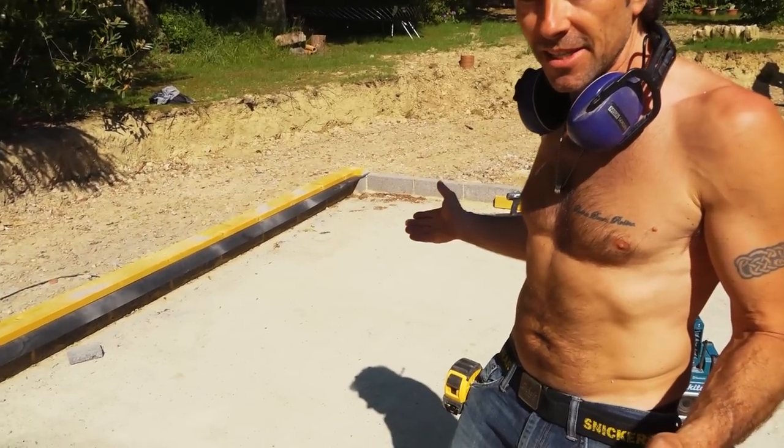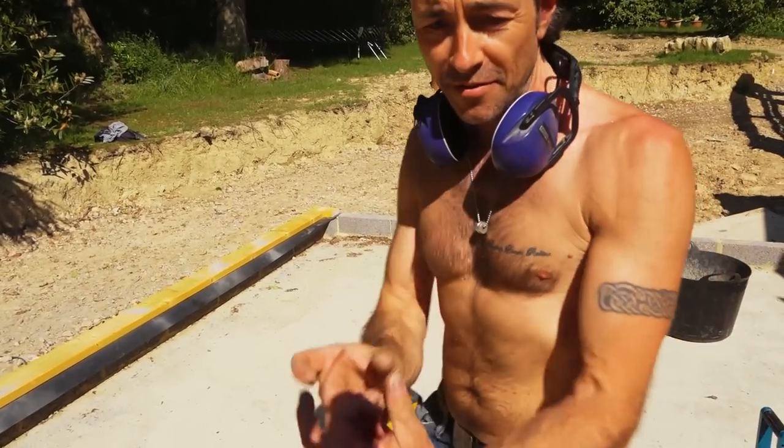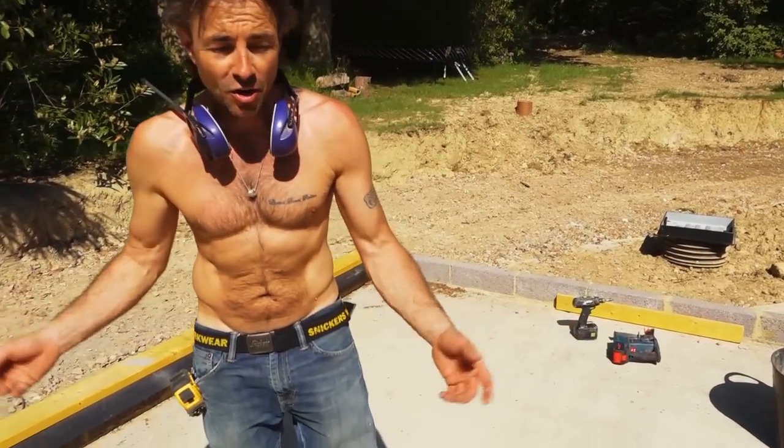If you're doing a timber frame or putting a roof on, you're going to have wall plates or sole plates. I've just done a load of sole plates which I half lap, because it gives a bit of strength — especially when you've got a small section that's only 200 mil long. If you add a little bit in there it's just going to split and break off.